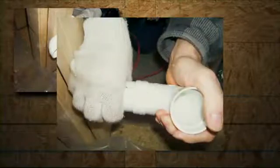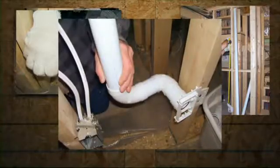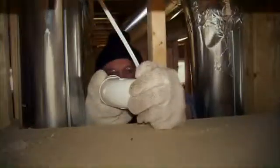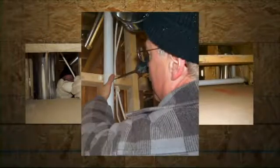From the lowest inlet, combine small, long 45, 90-degree elbows and PVC sections to deviate when necessary. Piping should be installed away from the beams. You wouldn't want pipes pierced by screws during drywall installation. When you must laterally deviate to reach another outlet, the horizontal portion of the pipe must be laid at level. Use piping fasteners as you lengthen the pipe.